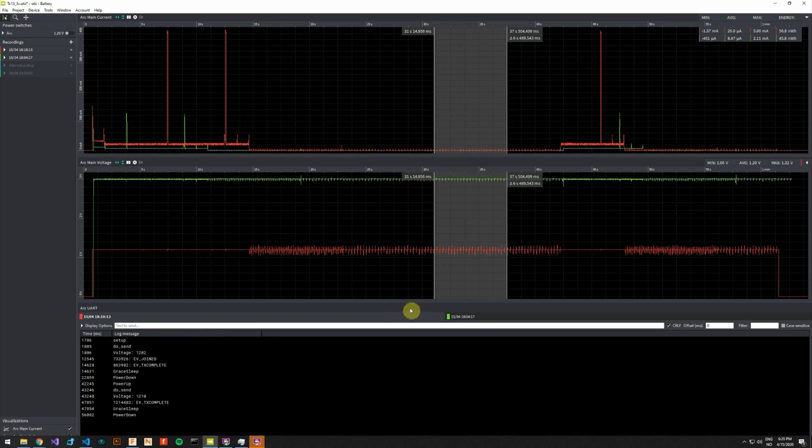And we can see the debug outputs from both of our runs. At this point we are in deep sleep, and in the first run, I remember that we were about 8.5 microamps. In the case where the batteries have dropped in voltage, the consumption is much higher. The regulator has to work much harder to supply. This is also very useful.